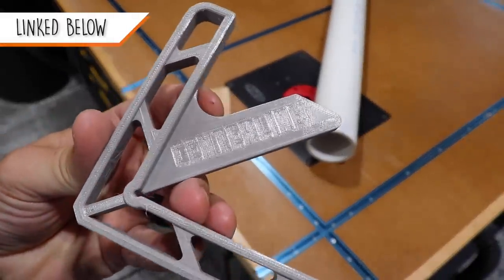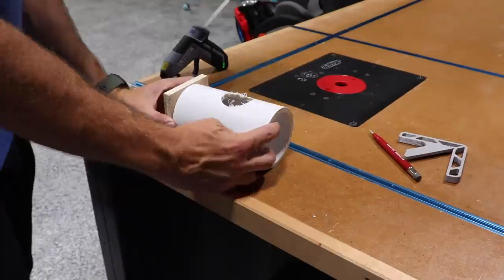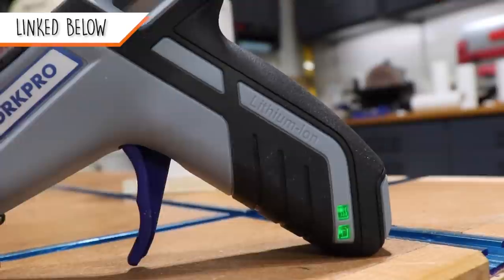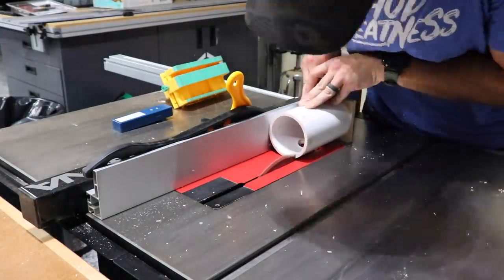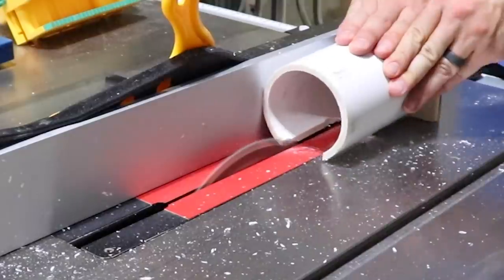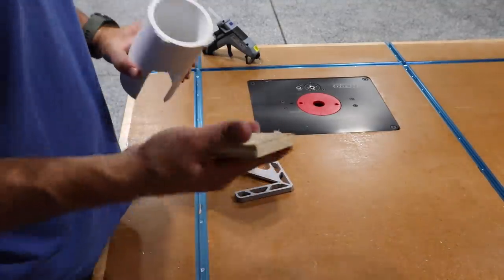Shameless plug for my little 3D printed center finder tool — use it to easily find the center of both round or square stock. You can snag one from my shop; check the links down below. I'm attaching a square block to the back of each PVC pipe section so that I can cut the straight sections on my table saw. I really need to use hot glue more often for temporary stuff like this, and this little rechargeable hot glue gun is really cool — I'll link that down below as well. This took some trial and error to get right, and I actually still managed to overcut some of them, both on the width and how far I needed to travel so I didn't cut past the hole. On the first piece I was just trying to sneak up on the correct fence position for each side. Once I was done, I just peeled off the block and used it for the remaining PVC sections.